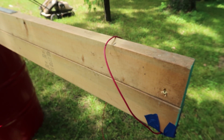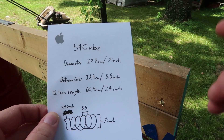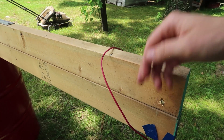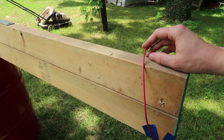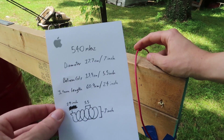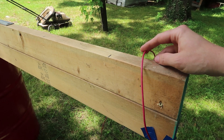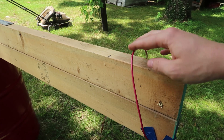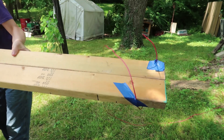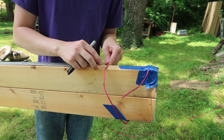The actual circumference is 22, going to 24. The spacing between coils should be 5.5 inches, and half of that would be 2.75 inches. I hate Imperial but I know most viewers will prefer it, since this is mainly for the US. I'm going to change that — it's a shame I don't have a good way to fasten it other than tape. So I've marked out 5.5 inches.